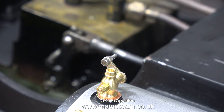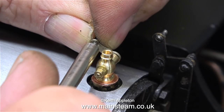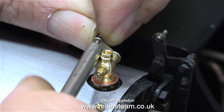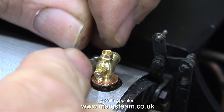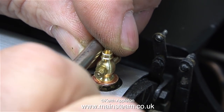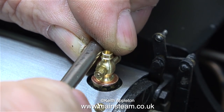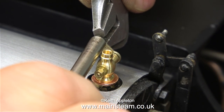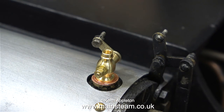It's not a good idea to use bolts as bearing surfaces, but really making pins at this size would be a real pain, and they don't wear — they really don't wear hardly at all. Using bolts for valve gear components is out of the question; any parts that move a lot like valve gear components definitely need bearing pins. A screw thread as a bearing pin on valve gear is definitely to be avoided. But as I've just mentioned, it's okay for this application because the draincocks don't get moved all the time.